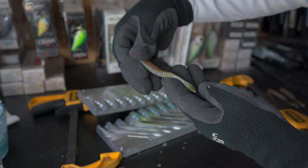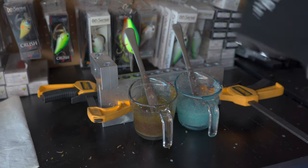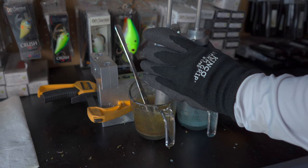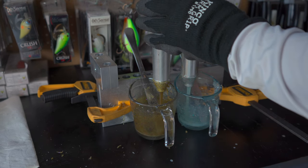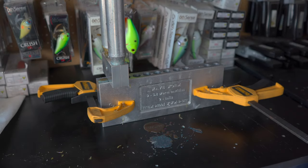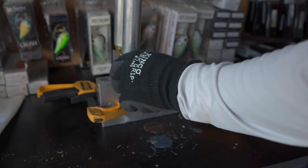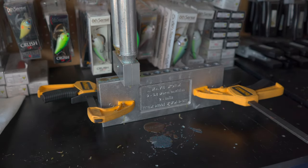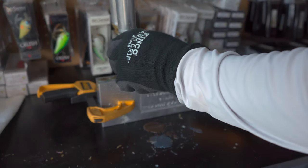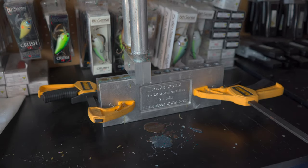It's time for round two. Get everything stirred up nicely so that salt is everywhere, then draw up the plastisol — good flow. With even pressure down like last time, I'm going to use less pressure to see if that helps with the beginning worms, because those are the hottest at the start. As it takes time to pour all the cavities the plastisol cools, so I'm hoping less pressure gives me better laminates from beginning to end.